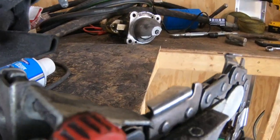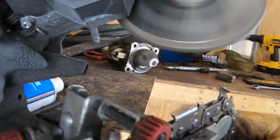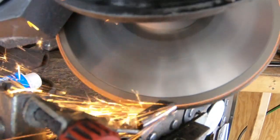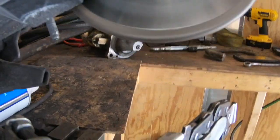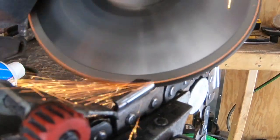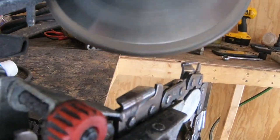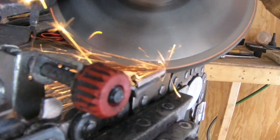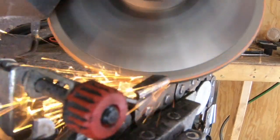You have to constantly set the depth that you're grinding down, and the small knob on the back, so it never really makes an even sharpen on the teeth of the chain, especially if you get a chain that's been rocked or dulled a little hard. But I always hated those things, and those were like $20 a piece. And I had always looked at these diamond plated steel grinding wheels, and they're like $100, $150, and I never bought one. And then I bought one last year, and it is nice because the shape of that cutting wheel stays the same all the time.